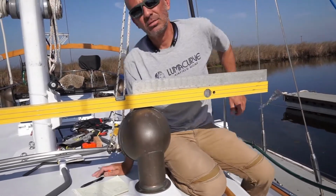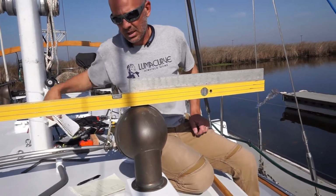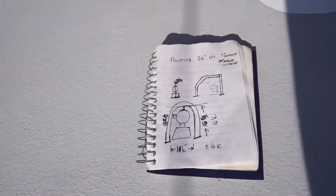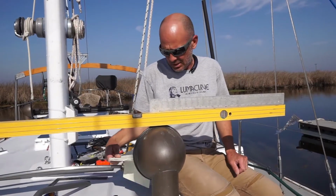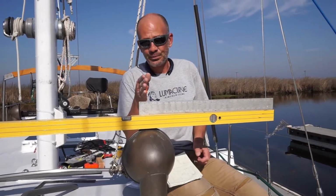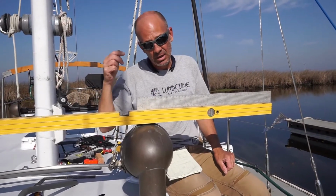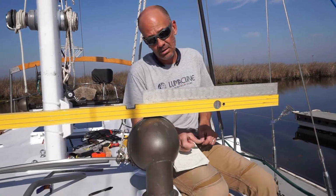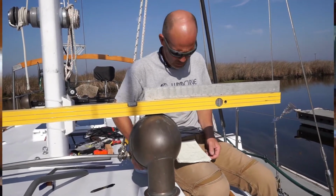Is it going to be bent? Yeah. I mean straight and then it goes down? Well, I was thinking kind of something like this. Yeah, exactly. Straight, down, 90. So I'll give them some baseline dimensions like the center line and the deck camber, and based on that they should be able to calculate how long the high side leg is and how long the downside leg is, or the long side leg, which is outboard.